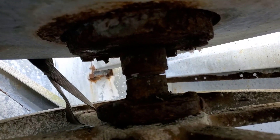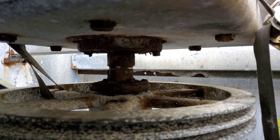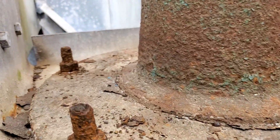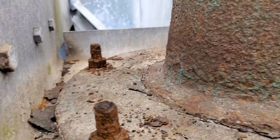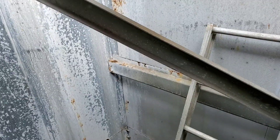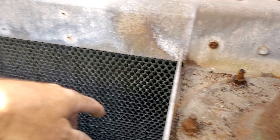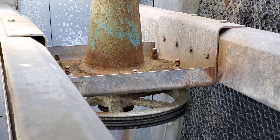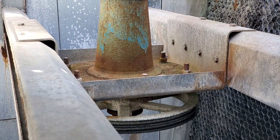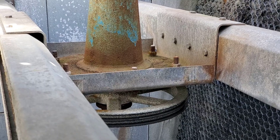I got most of the way through that shaft. Blade is dull. Waiting for my coworker who's not here yet. Those rusted-ass bolts — there's no way those nuts are coming off of that. We're going to have to torch these off or something. Trying to put impact on there — so far no good, we'll have to cut it. But see that other one over there, somebody's already changed it. Look at the threads — they're just night and day better. So that one we get over there will probably just come off.